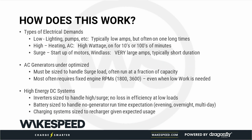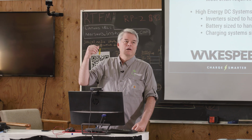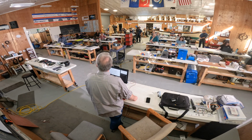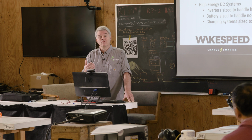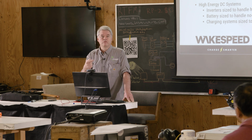And we've covered a little bit about this. How does it work? You need to optimize for your loads. Typically what we find, especially with these split voltage systems, and I'll put in a little advertorial here, I'd say 60% of our deployments are 48 volts. On the marine side, maybe 10%. But in general, about 60%. Marine hasn't really crossed into the 48 volt world yet. Part of the reason, to be candid, is they've got 24 volts, so they don't quite need it. If you start with the 12 volt world, it's all but impossible to do this. With 24 volts, we have a number of deployments, but 48 volts brings a number of good advantages.